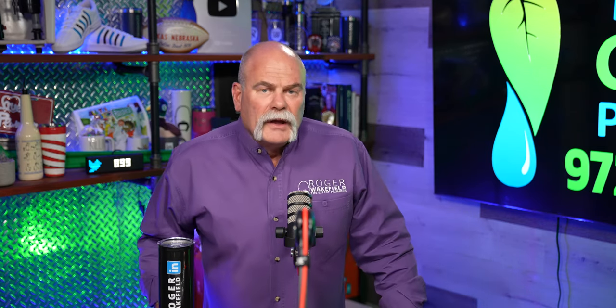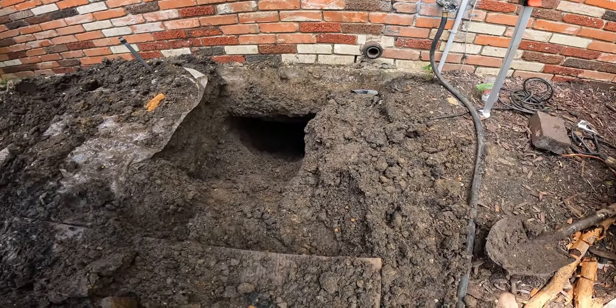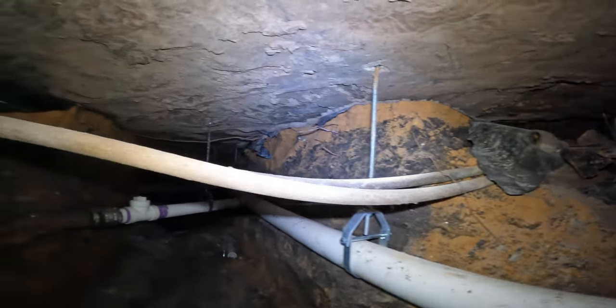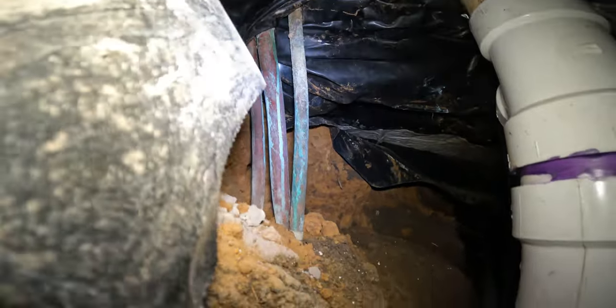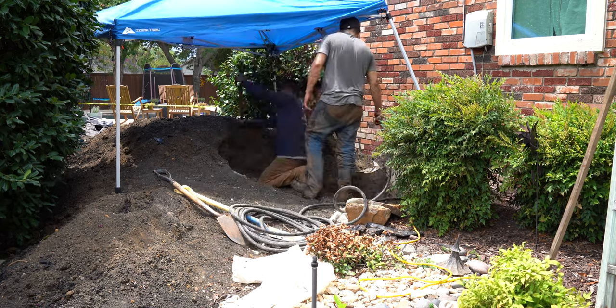So what are the challenges of tunneling? There are a few. Digging a tunnel the right way, you need enough room to get in there and work. When we lay out tunnels, we want to make sure we have access holes — there may just be one, depending on how far in the tunnel is going and where the actual spot repair is. The challenges you'll run into are what other lines are around there. We've actually gone into a tunnel under a house and found piers, previous foundation work, sewer lines we didn't know were there, and water lines coming up on a wall. There are things in there you may have to work around. Just make sure the dig crew you use is a professional dig crew — they're going to look at everything and do things right.